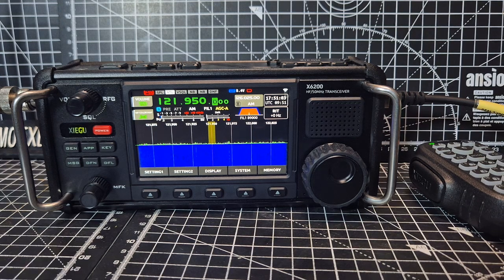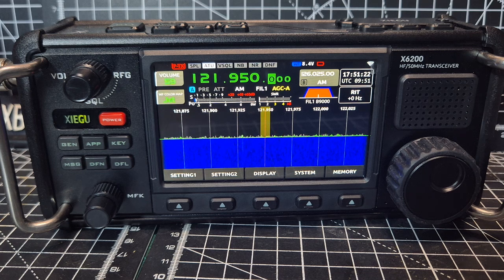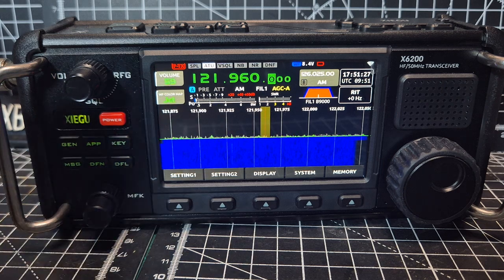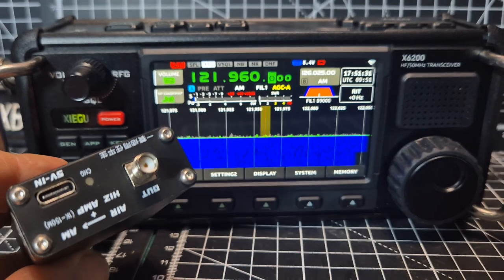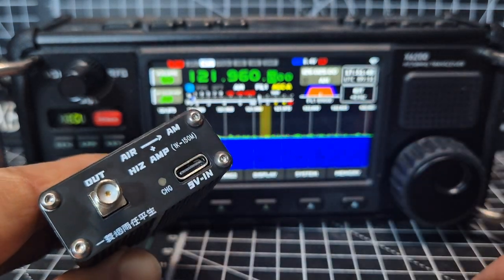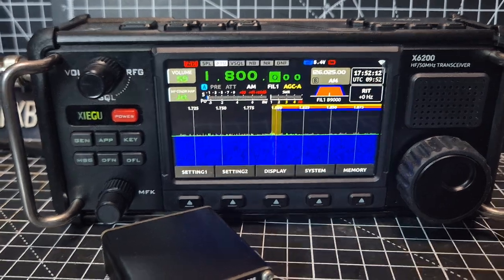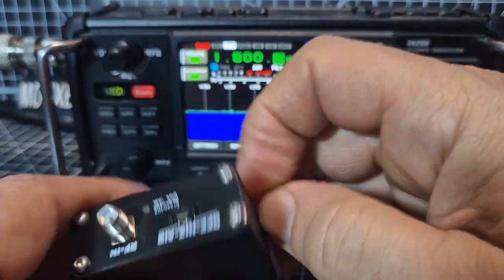That's a Bristol Airport frequency — you're not getting much there. Antenna considerations are so important; you really need a good antenna outside and up high for receiving anything. I feel I could probably get the frequencies I want using this little airband thing, so I'll just quickly connect it and show you. I'll try to type in 133.850 — enter, one, three, three, dot, eight, five, zero, enter — but it won't let me do it because most of my airband is over 130 MHz.